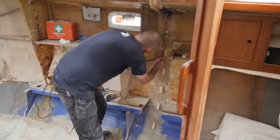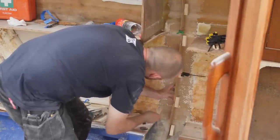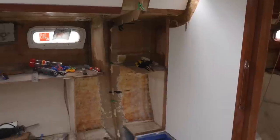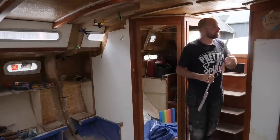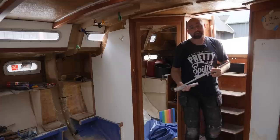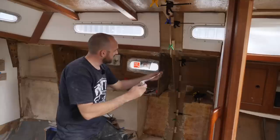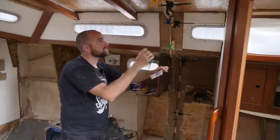It's just a matter of tracing the curvature of the hull onto the MDF and this should be a very accurate template. I'm pretty confident I'm going to get a good template out of this. All the plywood for the bulkhead will have to fit through the companionway hatch — it looks like I can get away with maybe 80 or 90 centimeters. I can rip the plywood to size and do the scarf joints up at the workshop, so all I have to do aboard the boat is put the pieces together and tab the bulkhead in place. The 80 to 90 centimeter width puts my scarf joint right around here, which is perfectly okay.